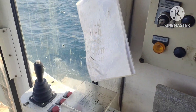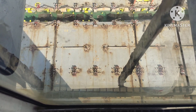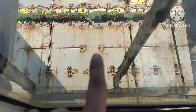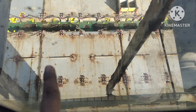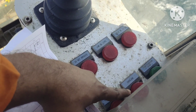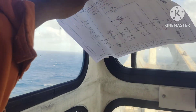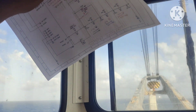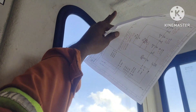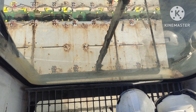When we are in port, we want to lift the hatch cover. You can see the hatch cover down here. We want to lift that middle hatch cover which is 34 tonnes. We cannot lift it. The other hatch covers we can lift at 26 tonnes. The overload alarm is coming here — you can see the overload light is on.